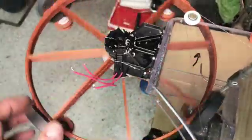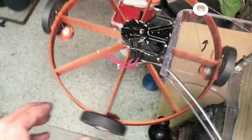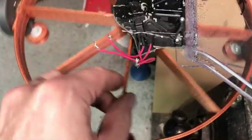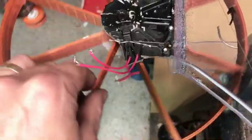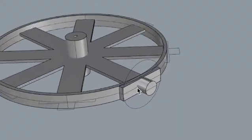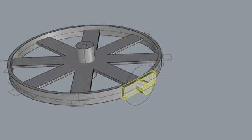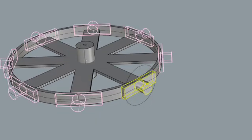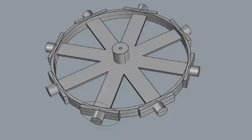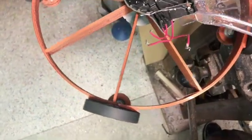I'm not so happy with the wheel — I think I need to redesign it. After the fact I also realized this is like a wind turbine, so it will also have wind resistance. I need to make these spokes so that they have less resistance, because I'm not going to run this in a vacuum. Let's see if I can manually make this run.